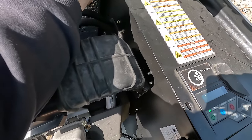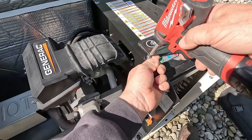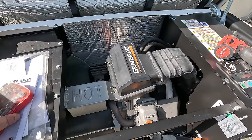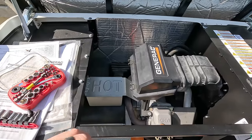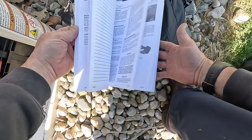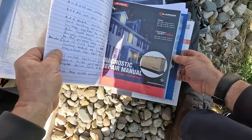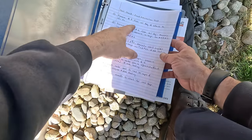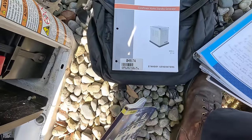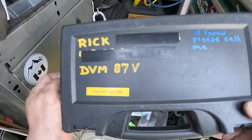We'll make sure everything's reset so the customer doesn't get a code about checking the battery. The yellow light on the outside corner has green, yellow, and red. Red means it's not going to run; yellow means a warning that it's time to check things over. Here are some of the books I've got — liquid cooled. Some of the old books they don't give you anymore, you have to use the digital copy, which I hate. Here are all my fast checks for fixed excitation to make things a little easier. Last time I went through it was Columbus 2018. I put the code on my notepad and made a tiny one to hide inside the unit, because a lot of the guys who just do the maintenance haven't been to class on this.